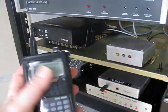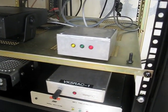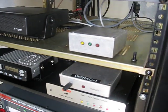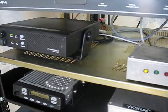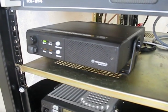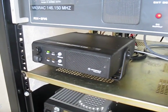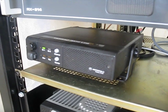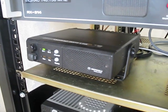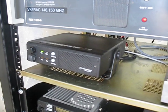I'll grab my radio — the trusty ICOM radio. There we go, you can see it receiving and transmitting. Next to that on the shelf is a UHF radio — this is a Motorola Radius E120, a 10 watt radio with power wound back to about 2 watts. This provides a link back to VK5REX, where we have our IRLP node — IRLP node number 6510. It's not on site here; we have a UHF link that interfaces into the repeater.